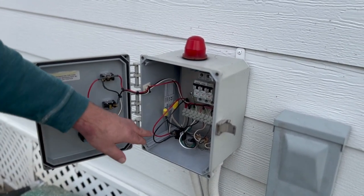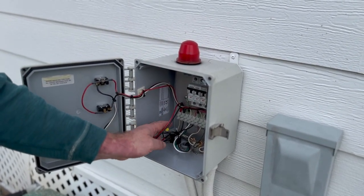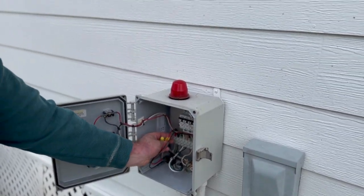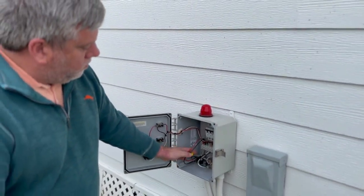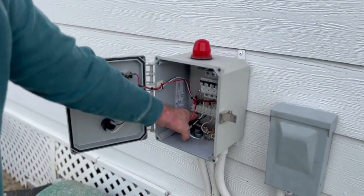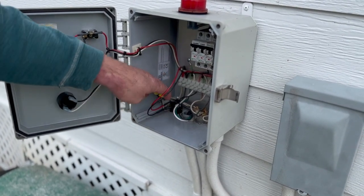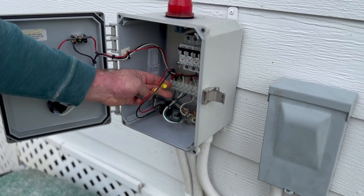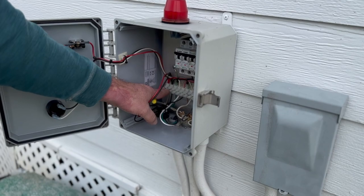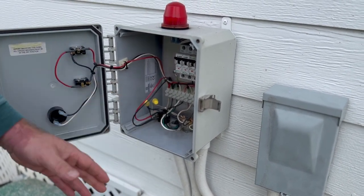The alarm float is going to cause feedback. This one's a panel we made up so there are some extra wires in here, but what you would do is disconnect these two wires. If the feedback went away, it would be a dead giveaway that it's the float switch, because these are the only wires coming through — the float wires for the alarm come in here and go into here. Disconnect these, or just one of them, and you get no feedback.